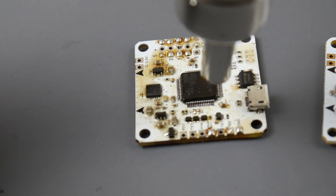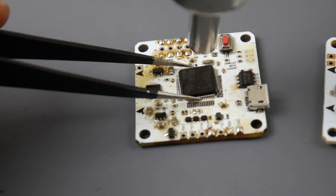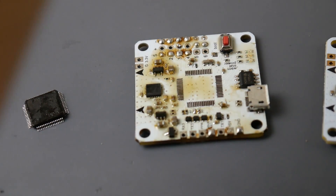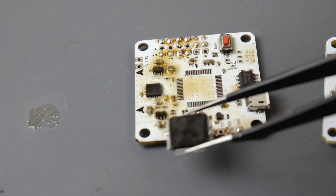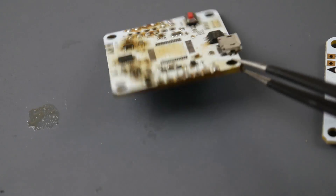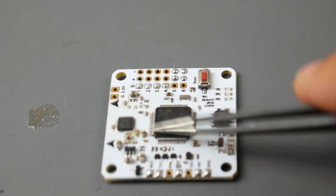It's taking some time because there are so many pins and the chip is so large — but there we go. I don't know exactly how long that took but I'll show it timed in the video. We just removed our F4 microcontroller unit. I probably overheated the board slightly, and that's exactly the reason why I really like using this tool with the preheating element.